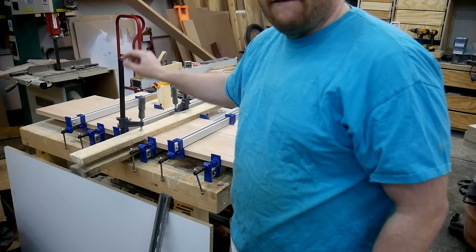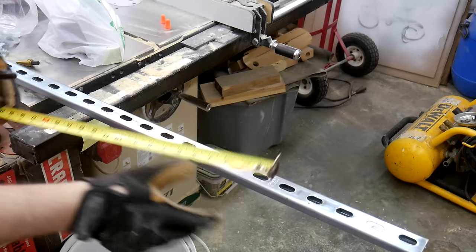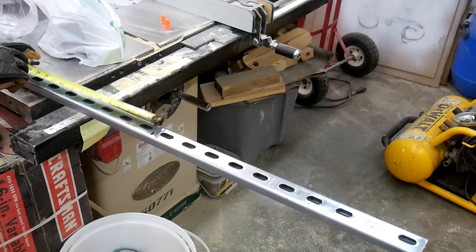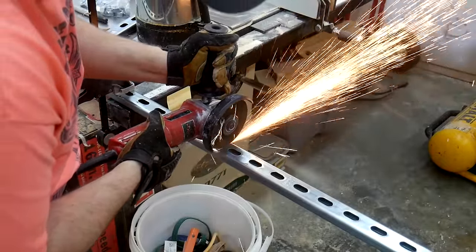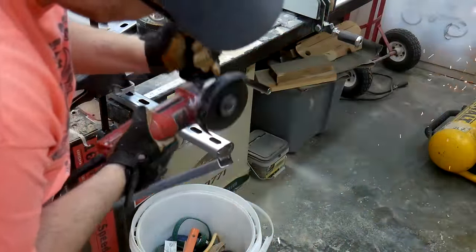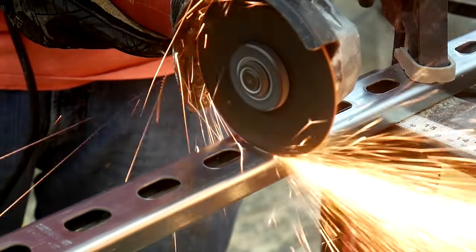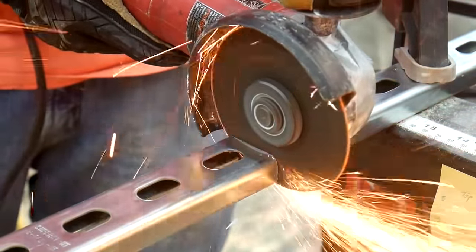First I'm going to show you how I built it, and then I will do a demonstration at the end of the video. I start out with this piece of Unistrut that I just picked up at my local Home Depot — you can probably get them for a better price if you buy them from an electrical supply house, but this was what I had available. The Unistrut comes in 10-foot sections and here you see me cutting them down to a workable size, which in this case is 20 inches apiece. I chose 20 inches because I wasn't sure how well this was going to work and I didn't want to waste material. These clamps will specialize in narrower panels, generally about 16 inches and shorter.